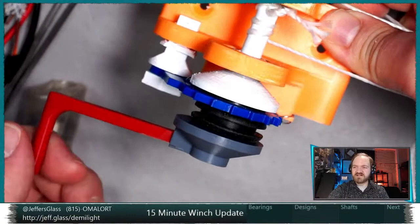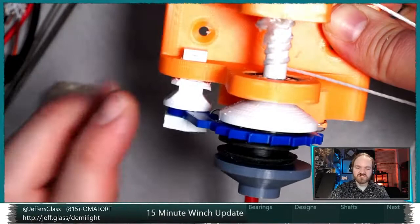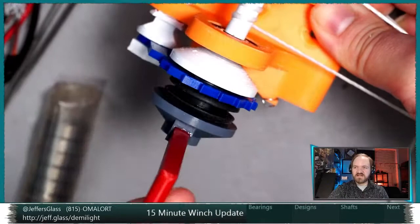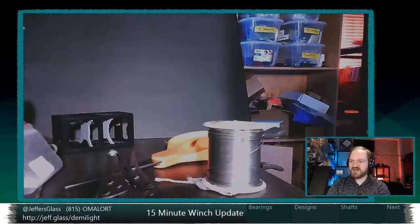the shaft is allowed to let out. As I rotate the handle the other way, it's allowed to click tight. But when I release the handle, there's no way that this shaft can undo itself. That's the clever thing about this mechanism, once you let go of the handle, it cannot move. I don't know if you can tell I'm holding this under significant tension, but it's still easy to let that tension off.